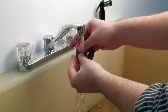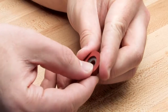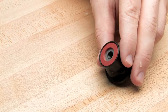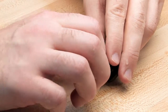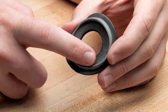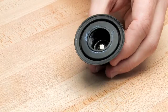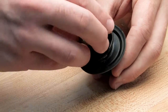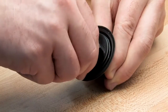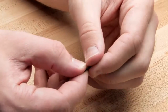Rinse each component to remove any dirt or debris and dry thoroughly. Begin by inspecting the disc for nicks or cuts and replace if damaged. Reinstall the disc rubber. Closely inspect the diaphragm for any nicks, cuts or debris and once again replace it if damaged. Once inspected, rebuild the diaphragm assembly with the molded step of the diaphragm pointed down towards the relief valve stem. Firmly tighten the nut. Inspect the relief valve seat and seat O-ring for damage or debris. Clean or replace as needed.